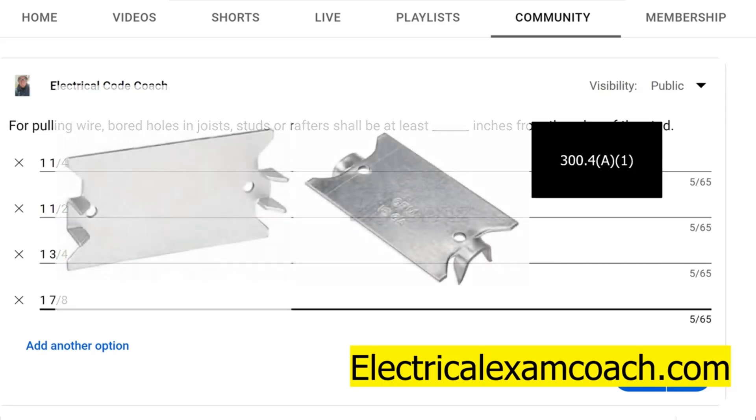They actually sell things like these — they're called stud plates, and they are code compliant. They must be at least one-sixteenth inch thick, but if you buy ones made for electrical, you won't have any trouble. You just bang those on with a hammer. So let's say you were running wire horizontally in a stud and your hole was closer than an inch and a quarter — you can come back, line this up on the face of the stud, and nail it on. It's a protective plate to keep someone like a sheet rocker or someone hanging a picture from driving a fastener into the wire.